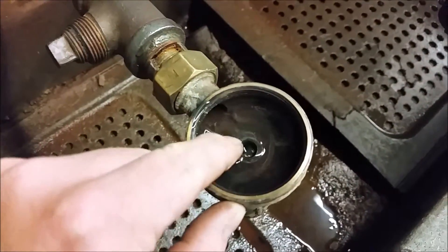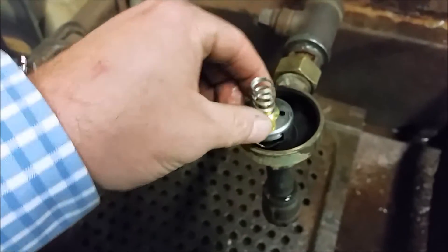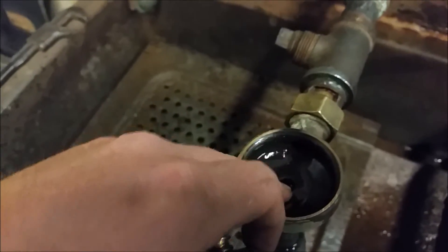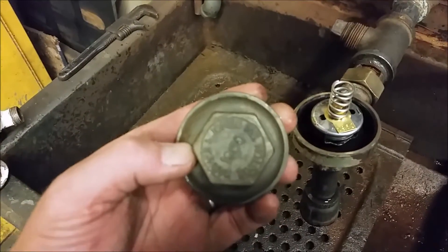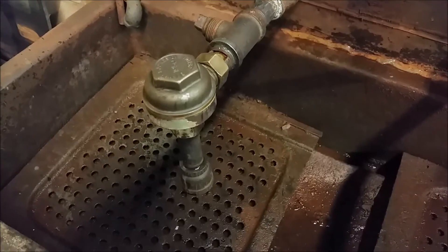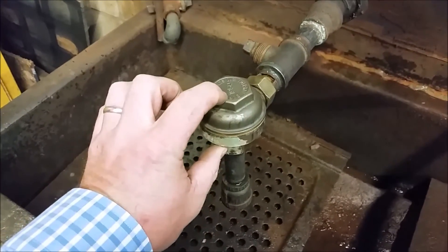It could have been a bad sealing surface. So it's a 1950 cage unit — I just made it myself — we'll put that in there. The difference is there's a gasket at the edge of this cage unit; it's going to seal up against that. Then we're going to put a 1950 cover on with a gasket. We've got the same Dunham number one with a 1950 cage unit, a gasket, and a cover. Same trap. Let's put the steam on.